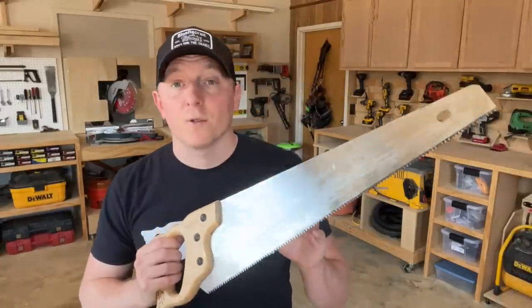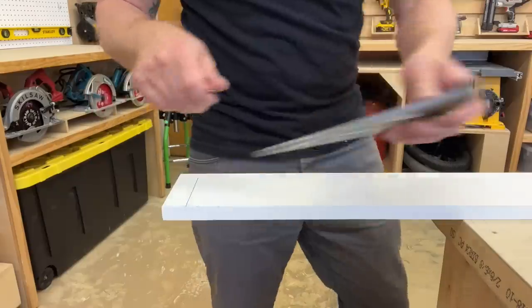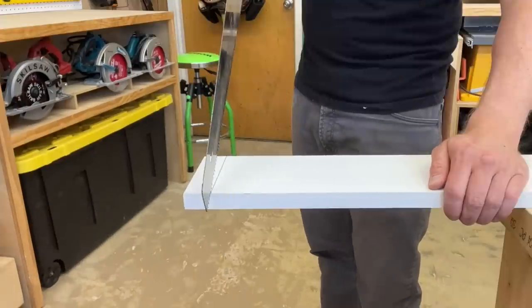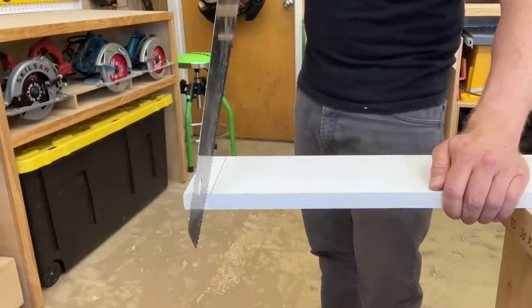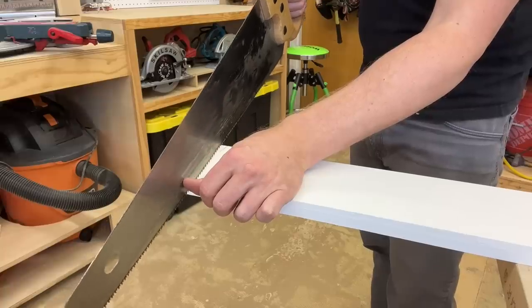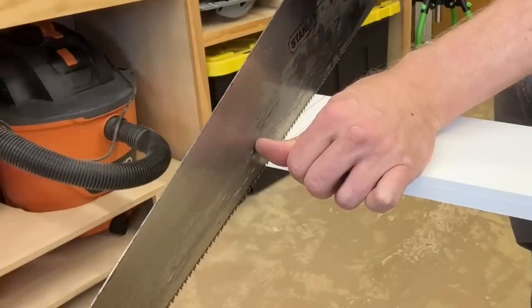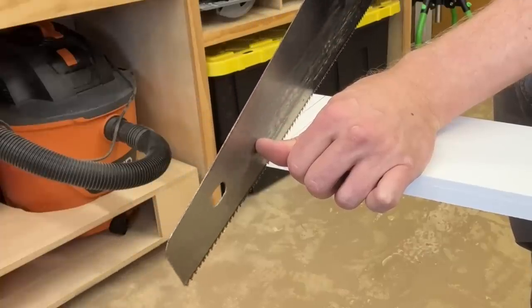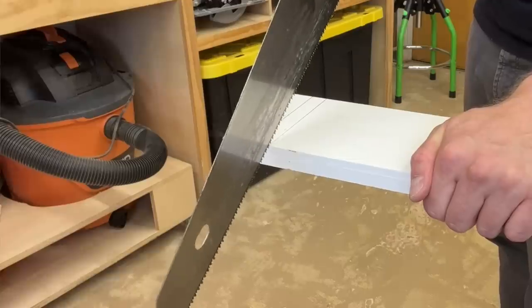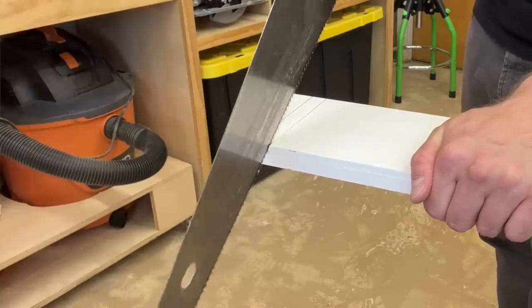You can feel this when you're cutting. Just try starting a western saw on a piece of wood. If you put the tip to the edge and try to drive forward, it can be difficult — the blade might bounce and jitter. This is because the blade hasn't gotten set into the wood yet, and each tooth is sort of catching on the edge. It's actually easier to pull a couple strokes back first, possibly stabilizing the side of the blade with a fingertip or thumbnail. It won't cut fast this way because it's against the tooth rake, but it'll still produce a shallow notch, which will stabilize the saw.